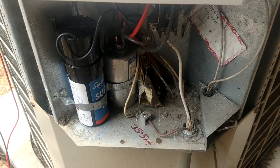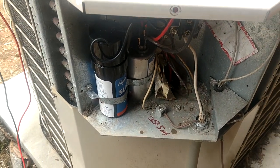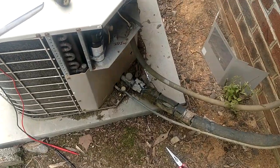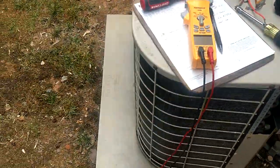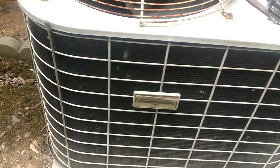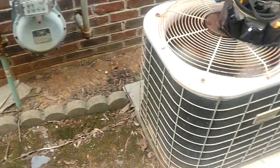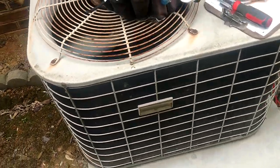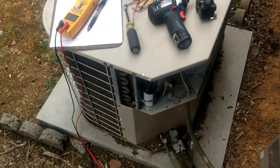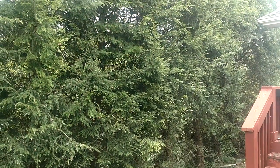The run capacitor was actually okay — a good old GE with that blue and white label. Those things were tough. It should live to fight another day. The refrigerant charge was actually okay on it too, checked it out. So the old Evcon will keep it going. I might grab this hose over here and give that coil a little wash real quick, knock some of the dirt off of it for him. But anyway guys, that's it for this one. Leave a comment below, like and subscribe, and I will catch you next time. See ya.